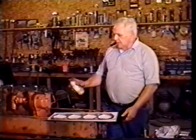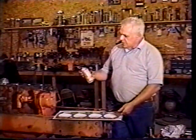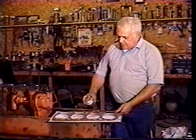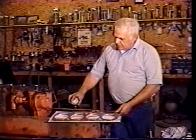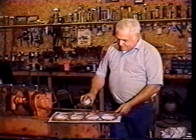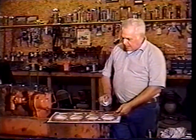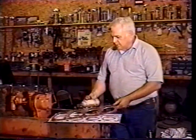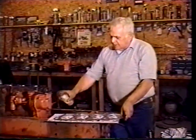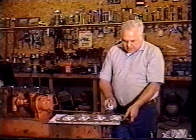We're just getting ready to put the head on the tractor, and I always like to put something onto the head gasket. We use this copper coat spray. I just lay it out and spray the head gasket a little bit ahead of time so that we have it coated, make a gasket sealer on it. I try to do that just a few minutes before you get ready to put the head on so this stuff really becomes tacky. And I spray both sides. Just turn it over. It comes with a spray can and just spray it on like some paint. And it'll make that whole head gasket just seal right up.